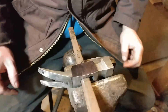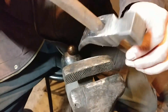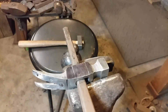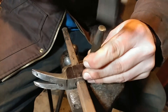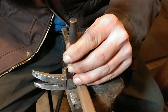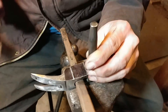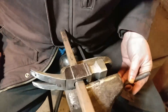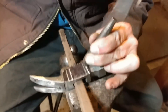The next step after I finish chasing the other side — as you can see, I'm just transferring what I already had on the other side to this side as well. I had to grab a little different chasing tool there and we're just going to town. You can see this is clearly sped up. At this time I didn't have my copper jaws in the vise so you can see the hammer kind of shaking around quite a bit. It really wasn't moving that much to the naked eye — it was shifting a bit, but this shows you how much deviation you can have on that.